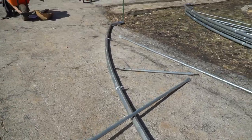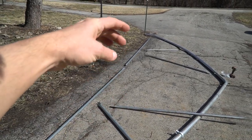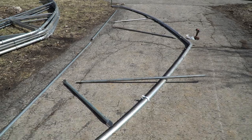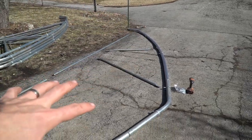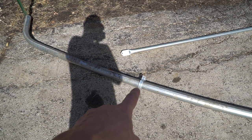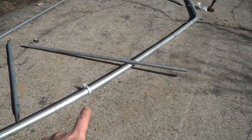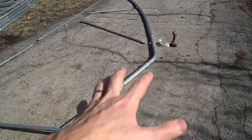We've got everything laid out where we're assembling it. The bottom of the truss is two pieces that run along the bottom, and then the support parts of the W-truss — a long post, then a short post, and the same on the other side. We assemble it laid out just so we have everything ready. The brackets around the big post are what hold all of the W-truss together — six of them on each arch — laid in the general area where they're going to sit.